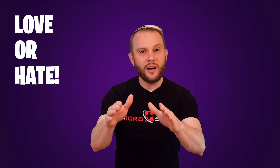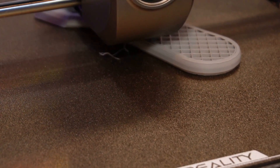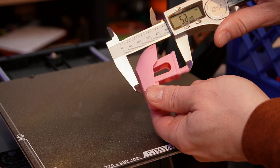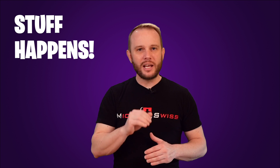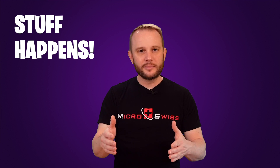Comment below and tell me if you love or hate glue sticks — I want to know. Think of adhesives like an insurance policy. Every single one of us has lost a large print due to bed adhesion issues — it's just a part of 3D printing. Adding a little extra something to help keep a print where it should be saves time and material waste. Dimensional accuracy is quite important too, so squishing down that first layer so tight that your tolerances are negatively affected, or having prints warp and change shape, isn't an option. Even the most careful among us deal with unexpected temperature changes, drafts of air, or goofy models with tiny parts that just won't stay stuck. And that is exactly why adhesives exist in the first place.